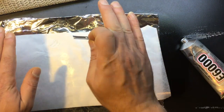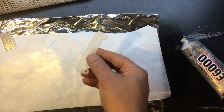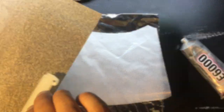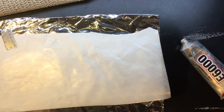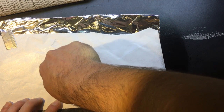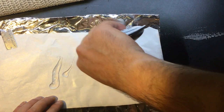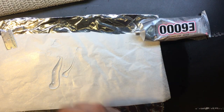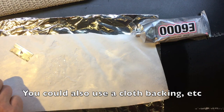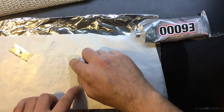You can see right here that it's kind of viscous, but like I said, it is self-leveling, just very slowly. These are the pieces we're going to glue together — this was part of a bezel that I printed out for an LCD screen. I snapped it in half, I'm going to rough it up with some sandpaper, and we're just going to make a hinge type thing out of that. So I'm going to spooge a little bit of this stuff onto the petroleum jelly covered paper, then use a razor blade to make a coating on the bottom, and lay the hinges on top so that the entire bottom is coated. Then squish them together so that you have a bead of the stuff in between the two.